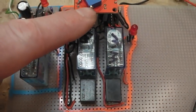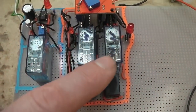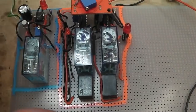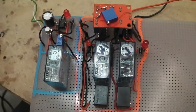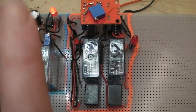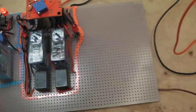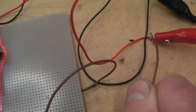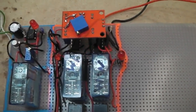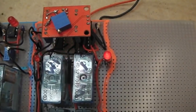And then that trim pot there is for adjusting the actual cycle of the automatic wash. It's pretty much going to stay set. We can trigger an auto wash now. This will keep on running, but this normally wouldn't happen. You normally have that separate. Just here is the trigger wire. Place onto 12 volts just there. This cycle then starts. I'm on now, so it'll trigger washing now.